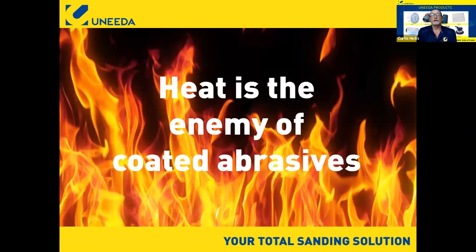Heat. I really like this slide. I hope the word heat burns into your brain. I'm going to talk a lot about heat today and the things we can do to reduce it. Remember: heat is the enemy of coated abrasives — sandpaper. Heat is to sandpaper what kryptonite is to Superman. When you introduce heat, the first thing that happens is it starts loosening up those resins, which hold the grain down to the paper. Anything we can do to reduce heat in sanding is critical.